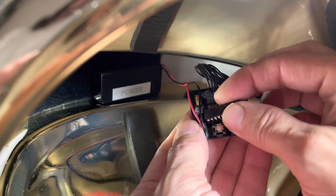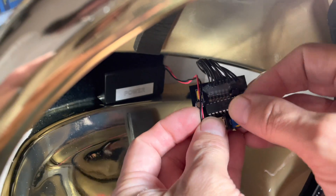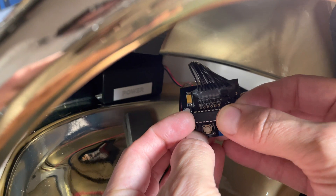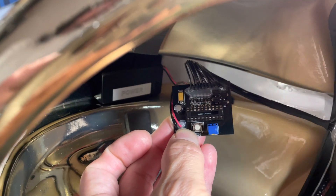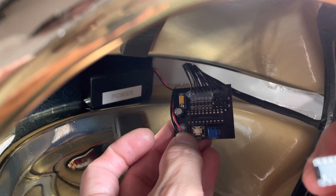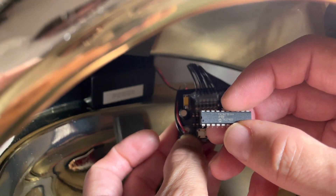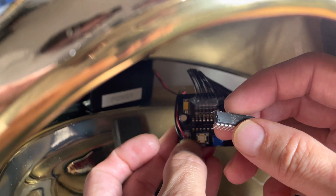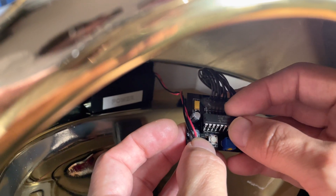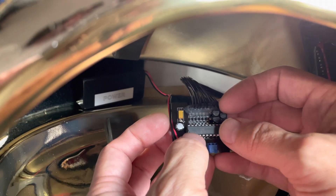The chip itself can come out freely now. You want to try not to rock it one way or the other so you don't bend the terminals — it just comes off quite cleanly. Then make sure that on the new chip, this notch marking is going in the same orientation as the previous one, with the notch towards the capacitor at this end.